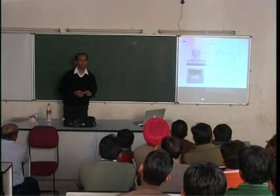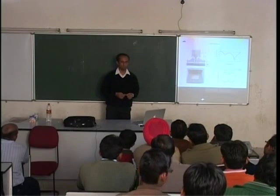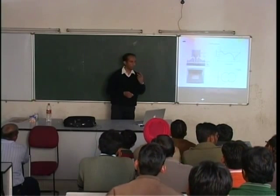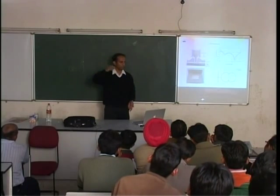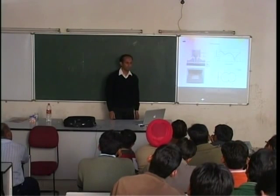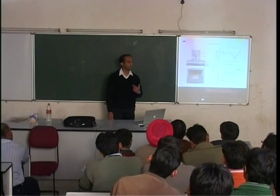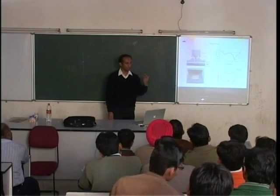Size of the antenna. That is the reason why if we wish to transmit our speech wirelessly, we cannot do it, because our speech is low frequency, kilohertz. If you directly take our speech, transfer it to the electrical domain, amplify that signal a lot, and try to transmit it through an antenna, it's not going to work, because you require an antenna which is kilometers in size, the wavelength at kilohertz. So what we do is modulate. Take our speech, modulate it with a megahertz or a gigahertz signal.